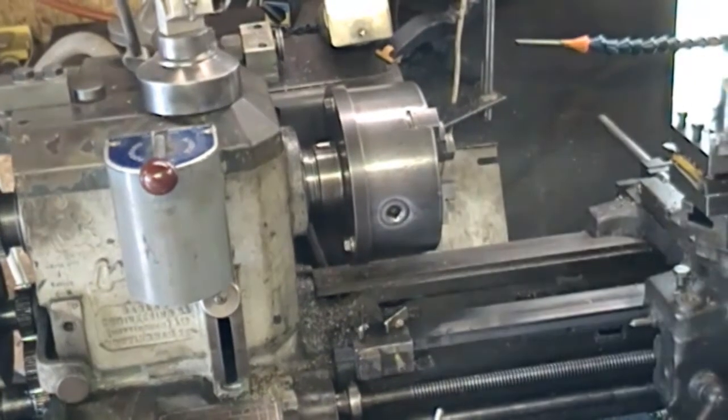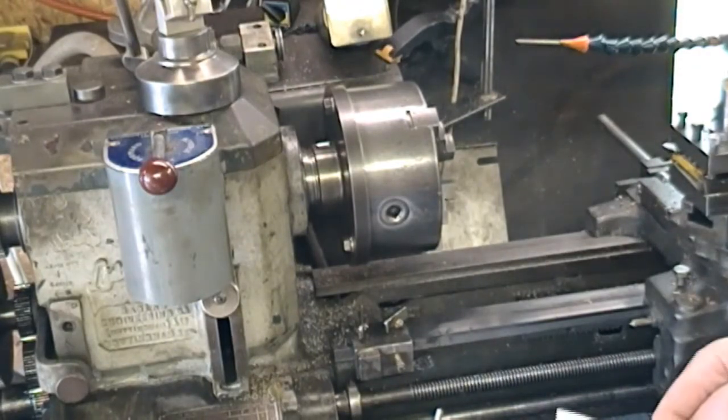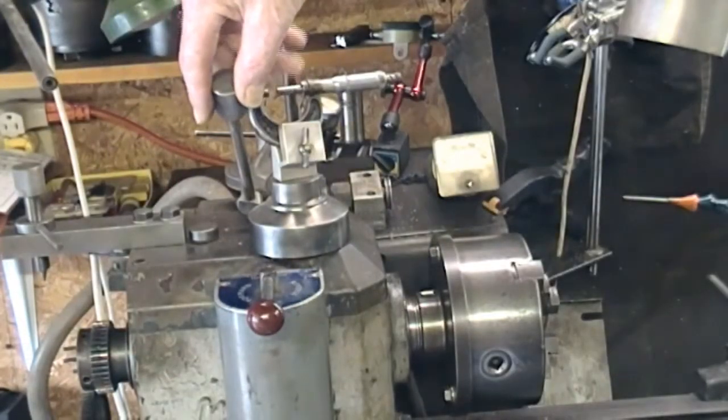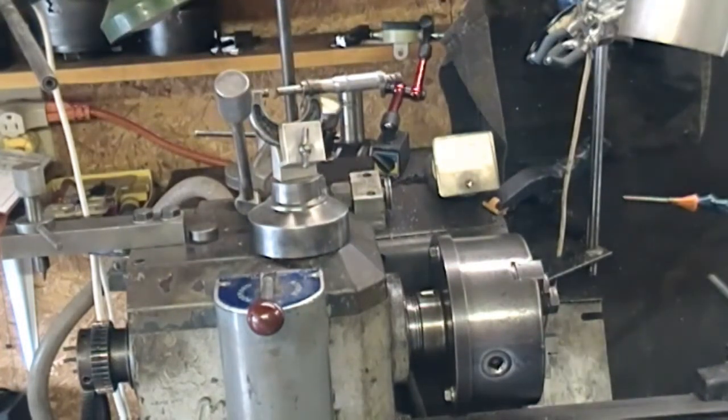On the main gear setup the nominal speed is about 580, and maximum speed — which I get by moving this lever backwards and forwards — is up to about 1300. Back gear gives 77 to 182 RPM. So I'm going to have to do some checking on this, but at least I'm getting what seems to be an accurate reading. For 15 bucks, incredibly good. I'll put the model number in the description. Thanks for watching.